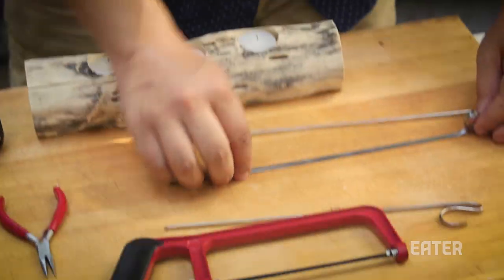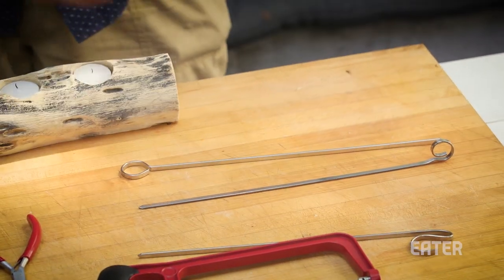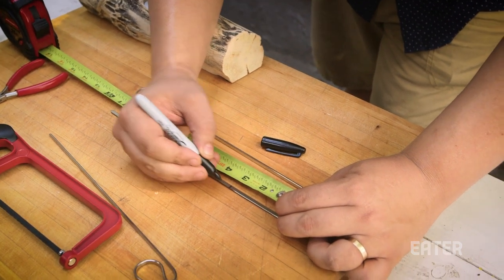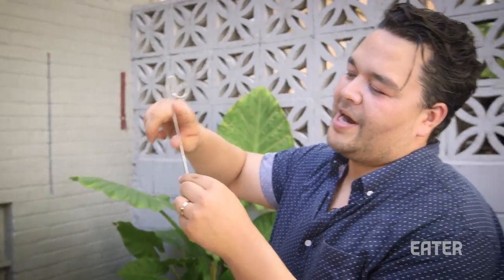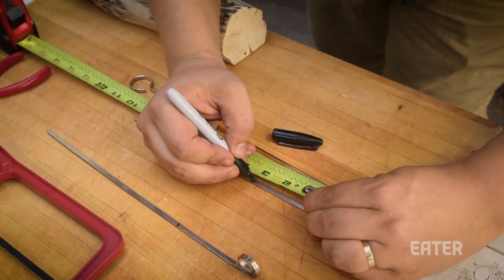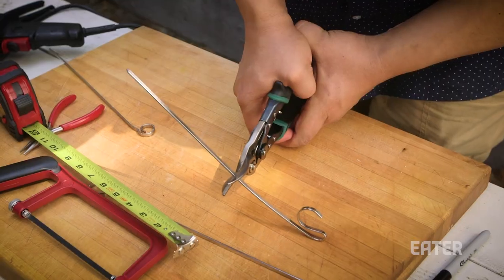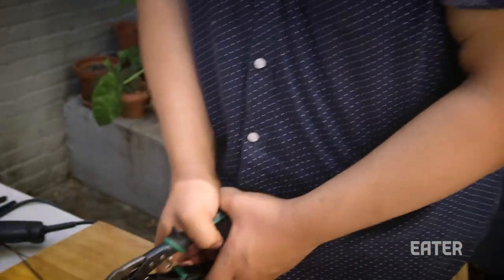One and two. And from the bottom point of the bend, take your tape measure and you're gonna mark three inches down — right there. That's gonna be your cut point. We're gonna repeat on this side from the bottom, three inches. Now this is the tough part — you gotta cut these. I have tin snips here; you're gonna sit right on that mark and watch your eyes.